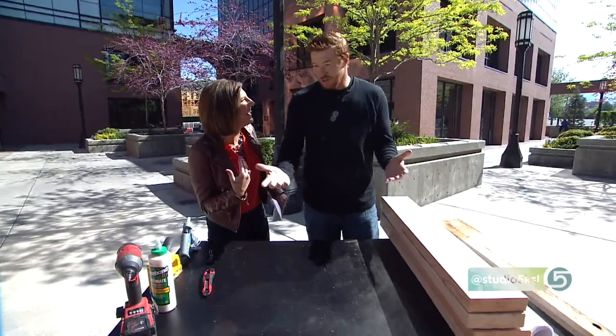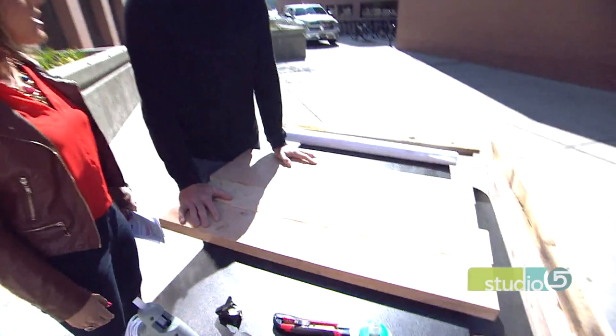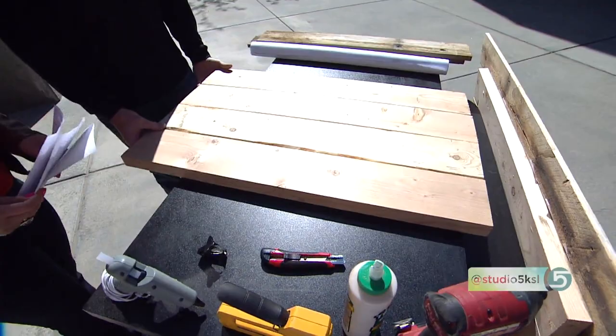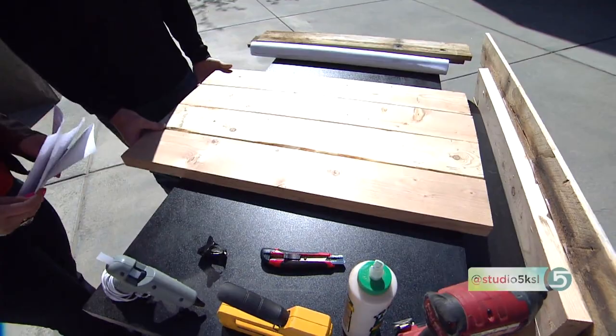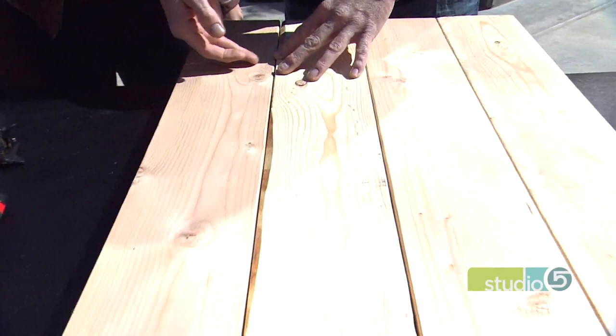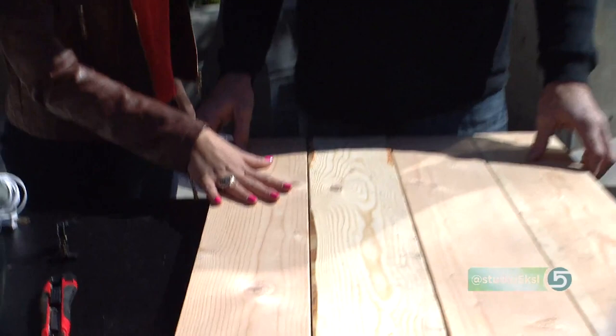How do you even start? Can I handle this? Oh yeah, I brought the tools for you. What supplies do we need and tools? We have a supply list which we're going to supply for everybody. We actually just went into our shop and found some stuff we had to build this — you can use anything. What you need to start out with is a solid surface. Here we've chosen some two-by-sixes. Once you get the two-by-sixes in, you can pocket join them, fasten them together however you want, or just use a piece of plywood. Pocket jointing is where a screw can go through this board into the next board. If you go to Home Depot and say 'I need a pocket joiner,' they know exactly what you're talking about.